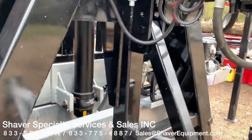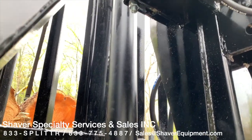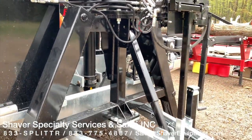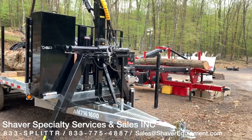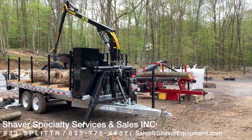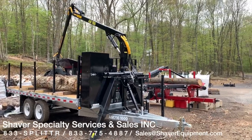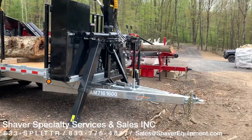The dump trailer does have a nice big telescopic ram that's in the front here, kind of big dump truck style. So if it goes on here, pretty much it will go up in the air. If you do have your own trailer or cab and chassis style truck that you want to mount a log loader on, we do that as well. Just need to know your dimensions outside to outside frame, driver side to passenger side, and top of frame to the ground, just so we can get the angle and the right length on the outriggers.